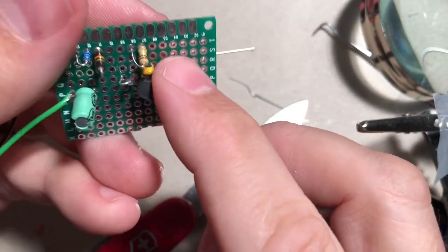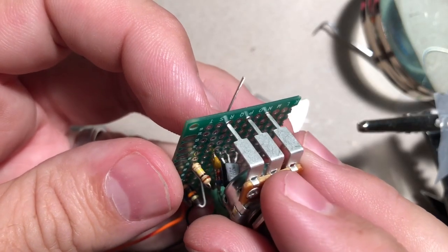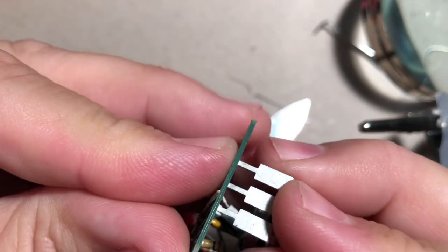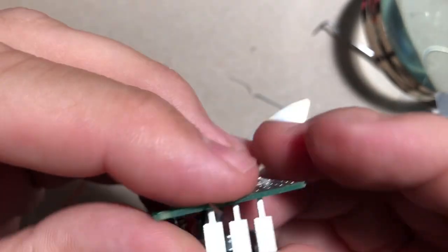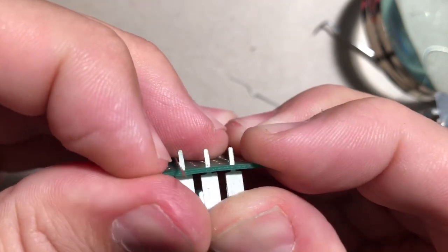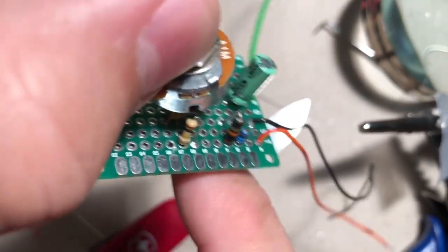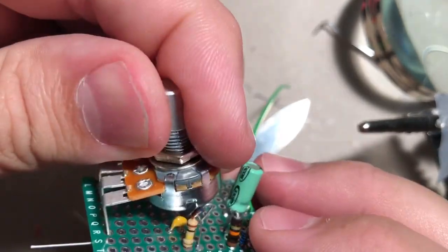Now we know from our diagram that this is the output signal, okay? So I'm just going to hook up the pot accordingly. And the spacing will be kind of like that. The pot that came with your kit, if you're having trouble getting it to go all the way through, you can wiggle it. Don't poke yourself, but it will fit. Now, if I had planned ahead a little bit better, actually this is good because then it's not going to ground out on a diode. But when it sits in there, it's going to be slightly angled, which is fine. It'll still totally work okay.